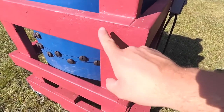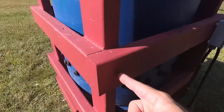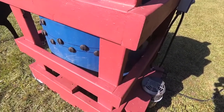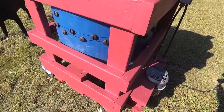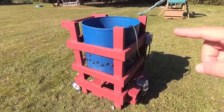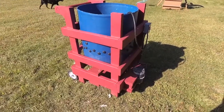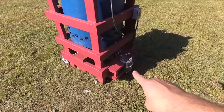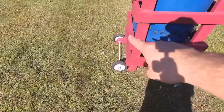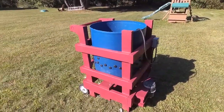The design in the book calls for carriage bolts — two on every single piece of contact — and lags for the sides. I basically have this all assembled with 3.5-inch exterior grade screws. I've processed about 70 birds through this and it does not look like it's going to fall apart anytime soon, so that saves you money. As for cost: I got the barrel for free, bought 4-5 2x4s and two 2x6s, received the motor for free — it cost me a case of beer from somebody I knew. I purchased the wheels, threaded rod, pulley kit, pillow block bearings, and waterproof switch.